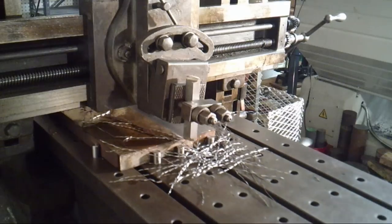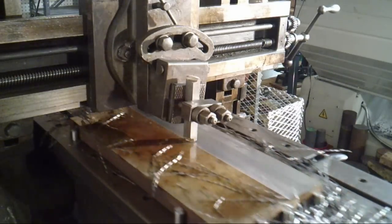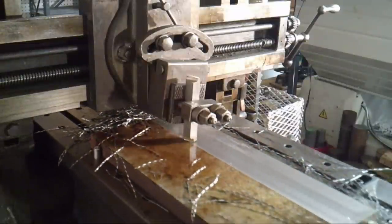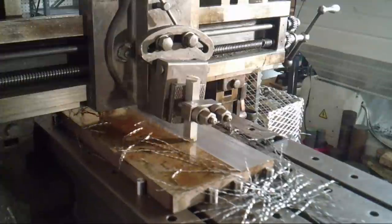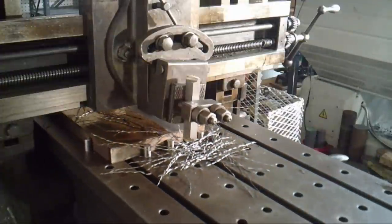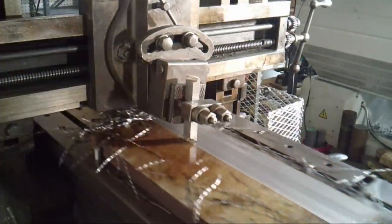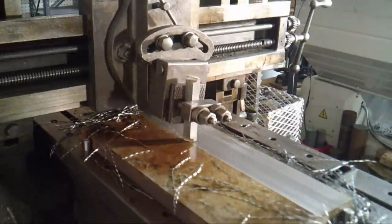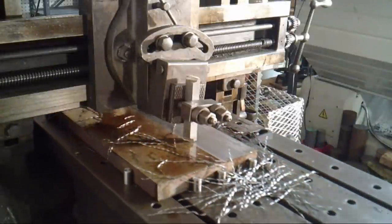But I'm really not surprised. I'm pushing the tool just a little bit deeper than what I had hoped. But it's going to be adequate — I want to get a smooth surface on one side, turn it over, finish the other side, and then turn it back and do a finish cut here. It's just going to take an extra pass. At the moment it's just a little bit rougher than what I had hoped, but let's let her cut for a while.